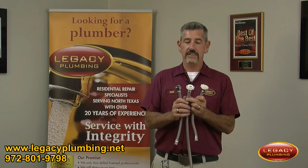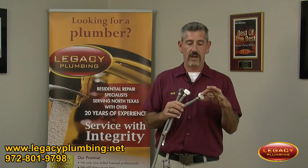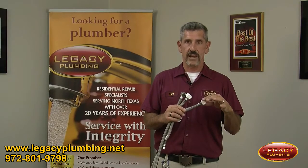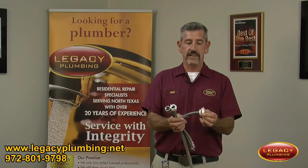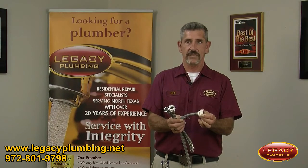These are three different kinds of toilet supply lines. This one here is the one that has a problem with the seam at the bottom that can split and flood your house. When I open it up, as you see, this has flooded a house recently — a client who just had it remodeled three years ago and now she's having to remodel again.